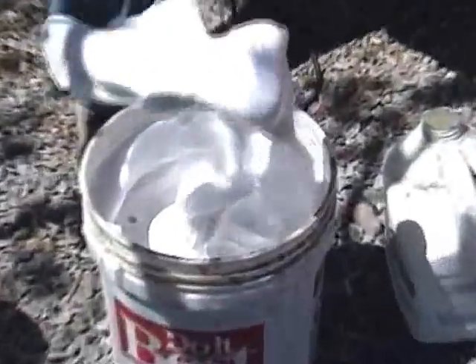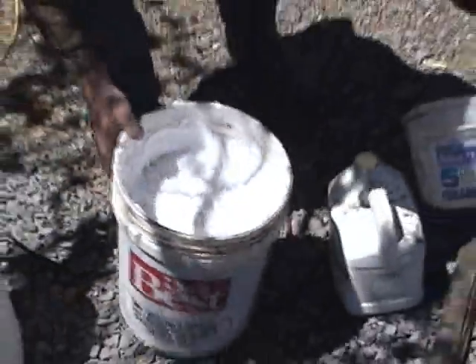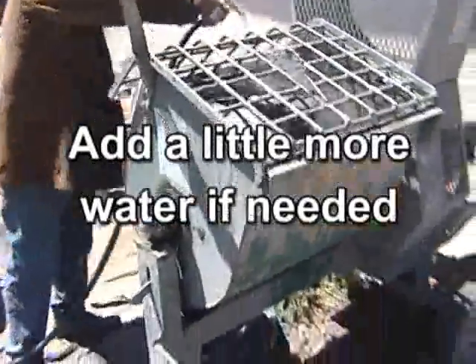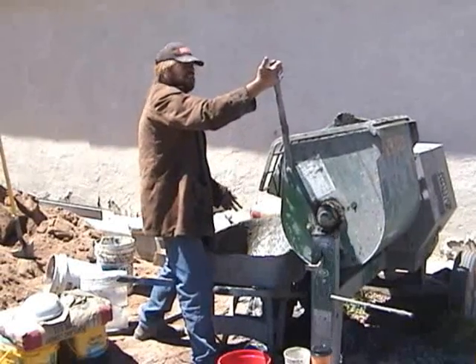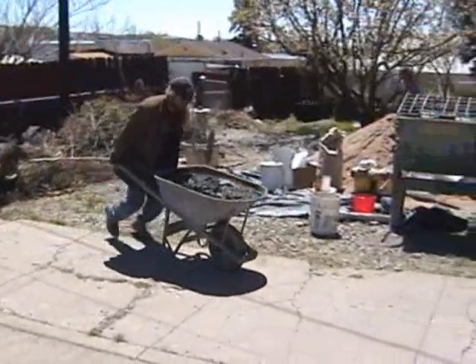You can start to see a little bit of rainbow iridescence in it in the sun — you know it's got a lot of small bubbles, and it'll do its magic. We have gotten away with just putting the dilute in the mix and waiting, and it could almost foam on its own. You can tell it doesn't have a lot of friction because of the aeration. This is how you tell it's a good plaster — by the weight, which is kind of a measure of the resistance. Here we have a full wheelbarrow, about three cubic feet of material in one batch.